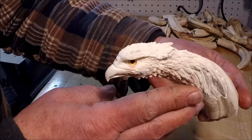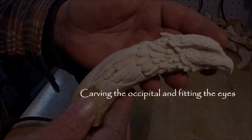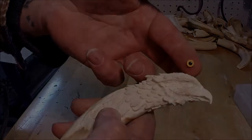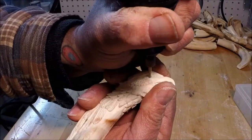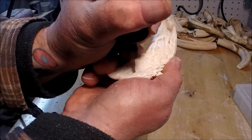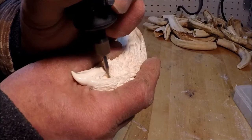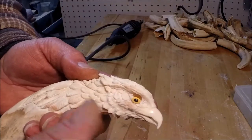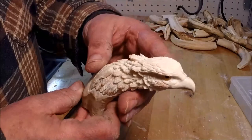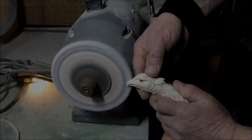Now it's time to take on setting the eyes. The eye socket will be created in that raised area that we made with the ball bit earlier. We'll begin with a straight cutter and sink a parallel depth for our eye socket. At more acute angles we'll start to really open up some space under that brow. We'll get in with a smaller bit, create more space up inside the lids. We'll slip it in on an angle and — voila — the lid will wrap around and hold the eye. Now we can finish the detailing around the eye sockets, go back through the entire project once again, tighten everything up, and move on to the sanding and polishing.